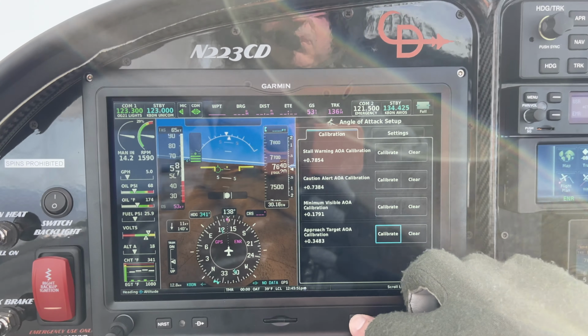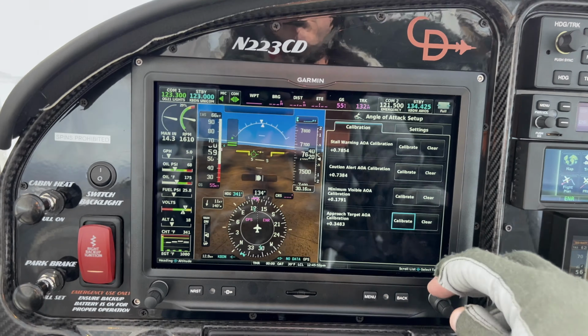You'd also want to see if your indicated airspeed is in the ballpark, right? If we're spending all this time getting a calibration curve, why not be able to put that calibration curve into our modern Garmin or Dynon EFIS? We're essentially doing the same thing with the AOA curve. We're taking a coefficient of pressure, adding a curve to that, and then deriving angle of attack from that. So why can't we do that same simple calculation in these modern avionics and display calibrated airspeed?